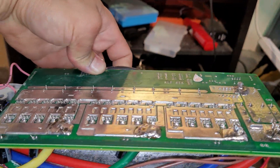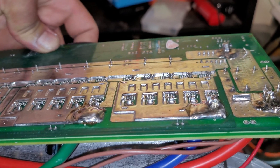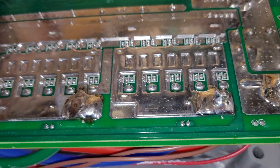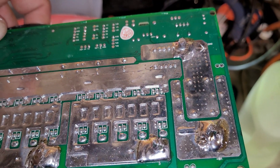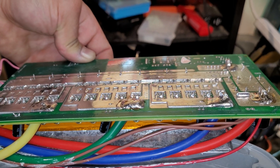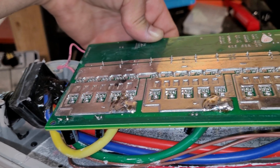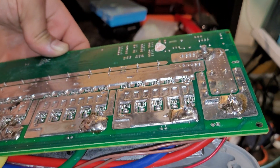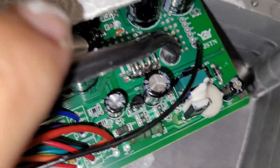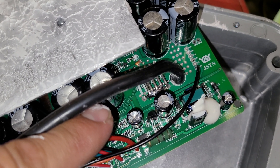You can see this board has a lot better traces. It actually has CNC-routed copper plates soldered on top of the PCB in order to give much better current handling capabilities. Copper traces within a PCB are usually pretty limited — you can't get significant amounts of copper in a PCB — so that's why they use wires or soldered-on traces through a flat piece of copper. Essentially all you're doing with the shunt mod is putting solder on those bars, or even replacing the bars with pure copper, to give you huge amounts of current over the stock system.